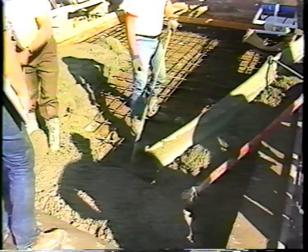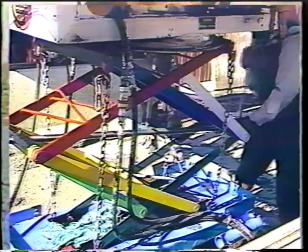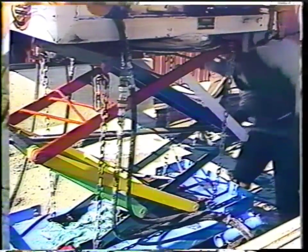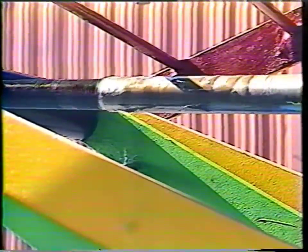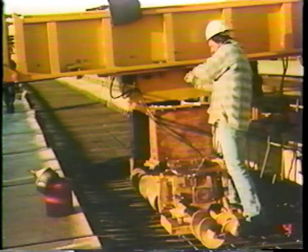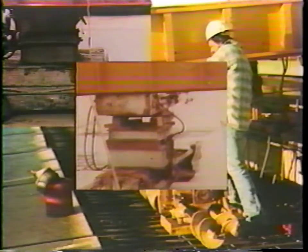And when we say the VivoPak 100 is right for your job, we mean it. This scissors extension is available as part of the VivoPak 100 system. This unique extension easily adjusts in height from 0 to 30 inches, eliminating the need for adjusting the legs or spacers between the carriage and the roller frame. All that's needed to adjust for varying rail heights is a simple adjustment of the scissors extension, eliminating costly downtime, any need for additional spacers, and the need for unbolting and repositioning the height of the legs.